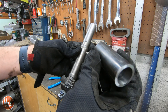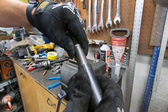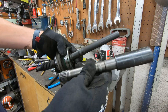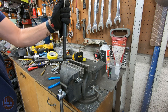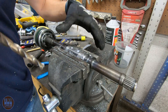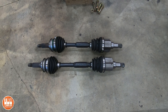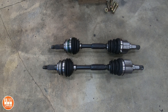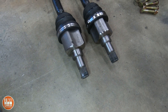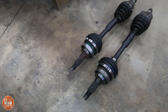To do this, I just cut up a Ford Fiesta axle and a Mazda Miata axle, and then made an adapter to fit snugly on both axles. I welded the adapter to the two axle shafts, drilled some holes for plug welds, and welded them up. Now we have custom axles with splines on one side that fit a Ford Fiesta and splines on the other side that fit a Mazda Miata. Will they work? I don't know, but if they don't, I'm going to blame Superfast Matt — it was his idea.